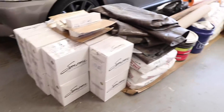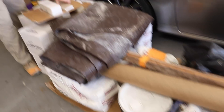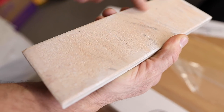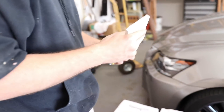Another beautiful spring day in northern California — pine trees, azaleas are blooming. Let's open up a box and see what the tile looks like. These are recycled roofing tiles with a glaze on them — look at that chiseled edge. I'll set them with a sixteenth gap and widen out to an eighth in a brick pattern. That'll look good — no liner or anything, just this tile.